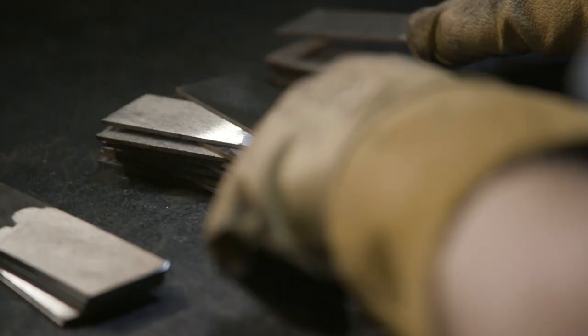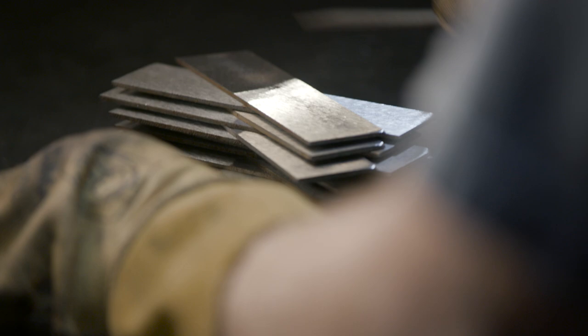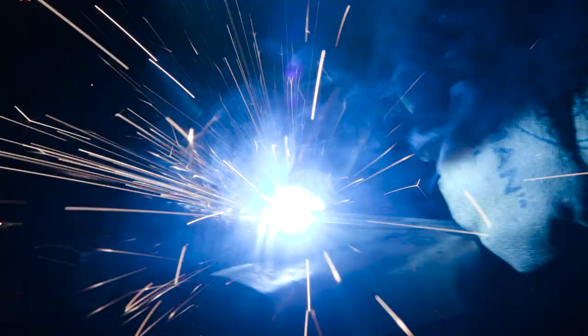You can see that I've already scuffed the pieces. The main reason for doing that is that there was a little rust on all of it, and we don't want any oxygen to get in between our layers during the weld. All I have to do is alternate the stack, get the billet welded up, hand it off to Ilya, and he'll begin the forging.